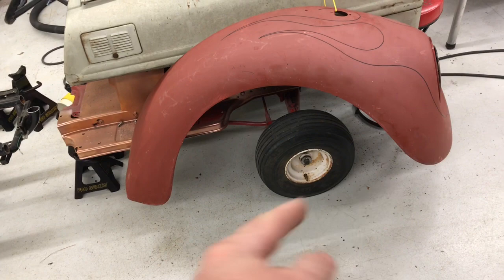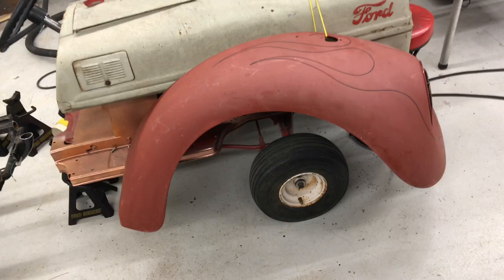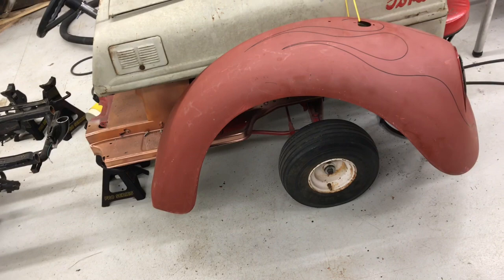So what I plan on doing is just putting a piece of sheet metal in here, coming across, rolling the bottom edge, and then welding it in so all of this is closed. Because I don't want to try to buy big wheels for it — these are going to work just perfect. And then these can turn in there and you won't see it.